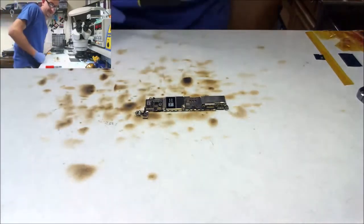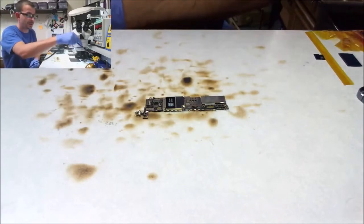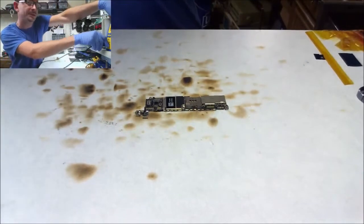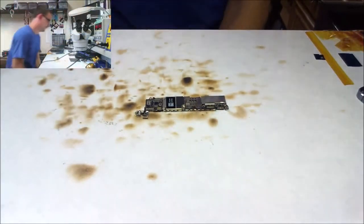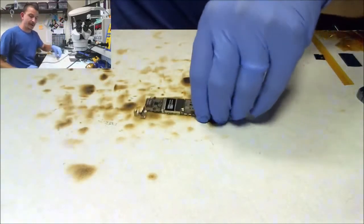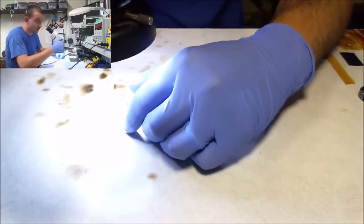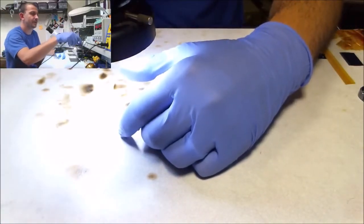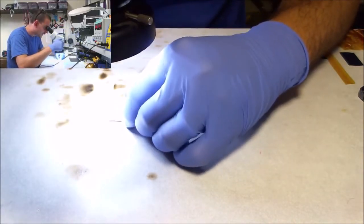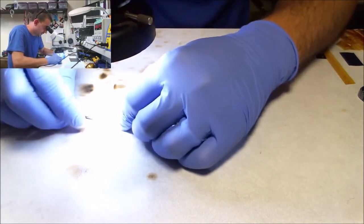Using my FM2032 micro pencil with the 0.1 millimeter conical tip with a very, very slight wedge filed onto the end of it. I actually put the wedge onto the end of it using this microscope. So let's have a look at this board. Am I at 800? Where are we at? 750? Cool, these are the ones without the end caps. Move these junk ass pins out of the way.